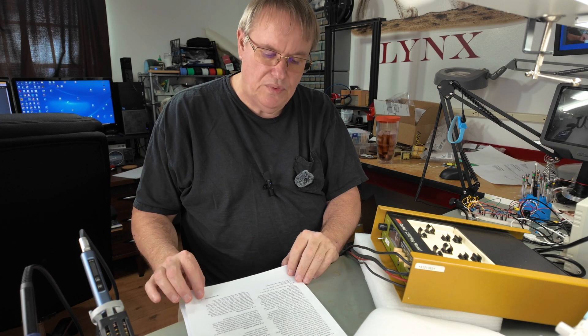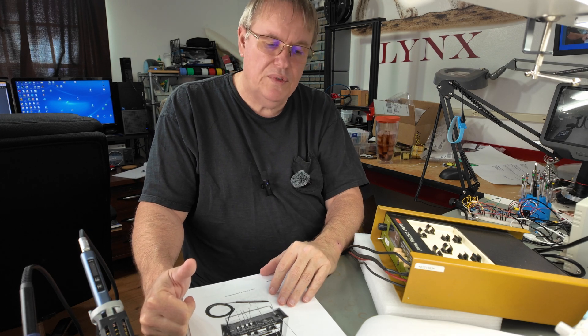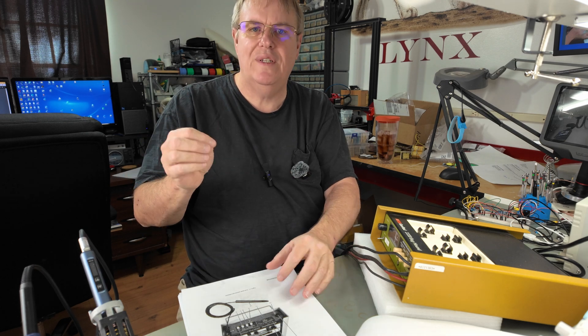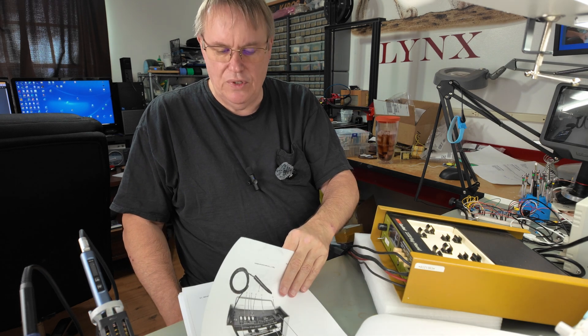The current sensing probe has a source drive signal of 600 kilohertz plus or minus 20%, one volt peak max into an open circuit, and 20 milliamp peak-to-peak square wave into a short circuit. The Genrad 2220 Bug Hound is described as a small benchtop instrument designed to aid in determining the physical location of a printed circuit board short or open circuit and certain types of component failures. It has three basic modes: signal trace mode, connectivity mode, and a microvolt meter mode. The microvolt meter injects current and allows you to follow the trace, seeing resistance fall off as you locate the short or open.